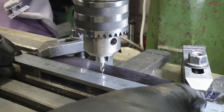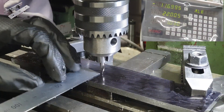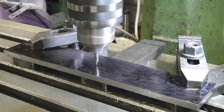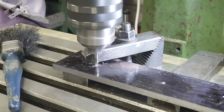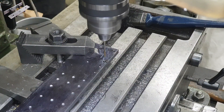Total length 234mm, 117mm to the centre looks good, and 22mm from the bottom face. With all of the holes centre drilled, I crack on and drill them all out to their required sizes.